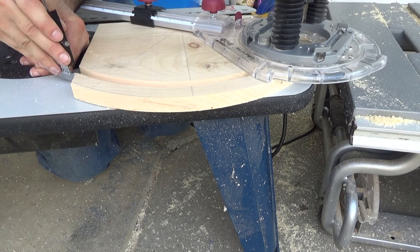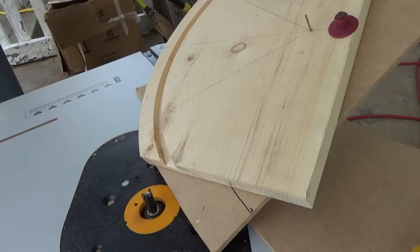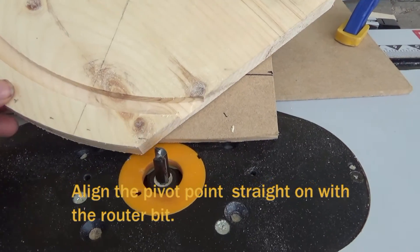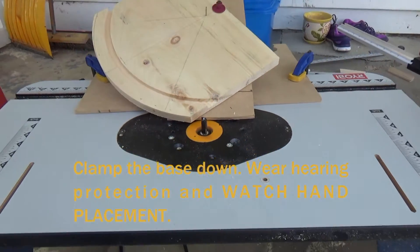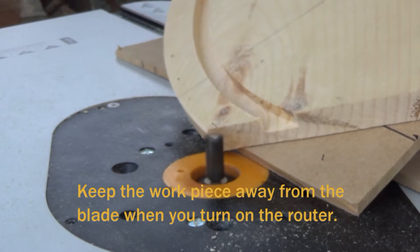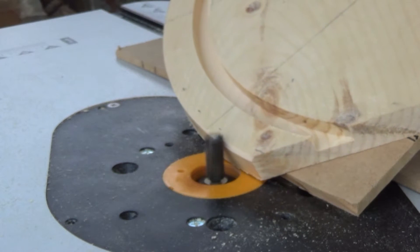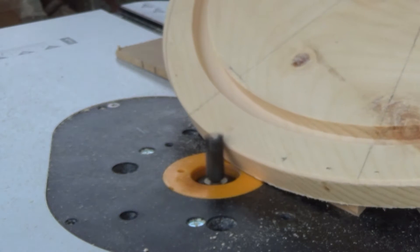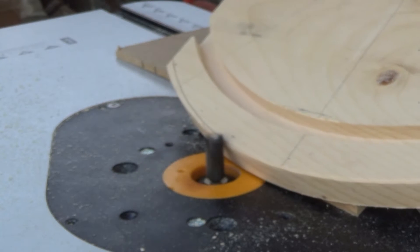Here is the jig that we have. I put a top on the angle, clamped it down on both sides, and had it rotate upon a pivot point so I can come into the router like I'm doing here — that's why we left that edge like so. Be careful with this and make sure everything is secure. It's best to make a brace that goes from the base all the way up to where this piece rotates on that pivot point so that it doesn't flex.